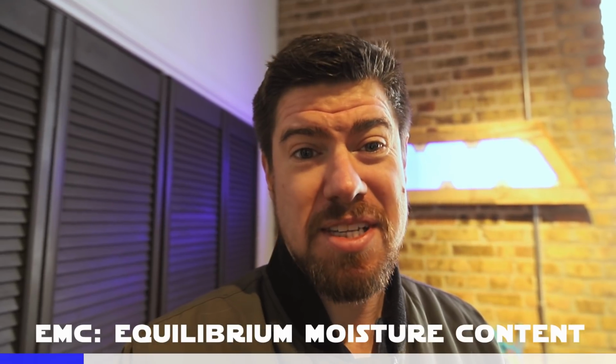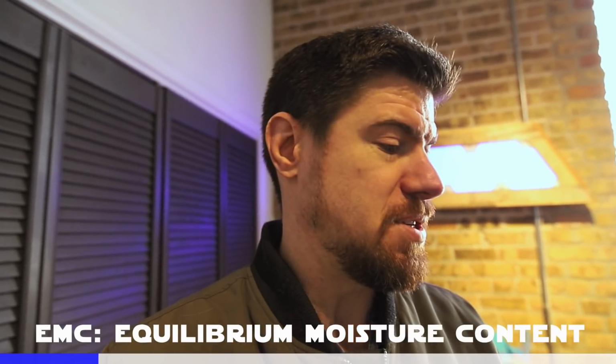So I'm going to start by measuring the equilibrium moisture content, or EMC, here in my loft for comparison purposes. So let's see what it comes in at. So here's EMC, about 8.1%.